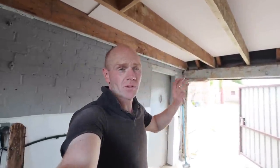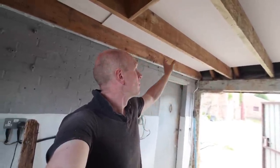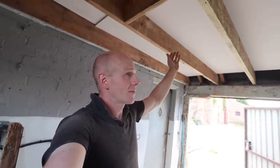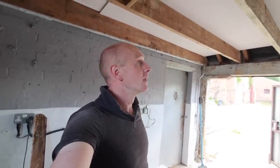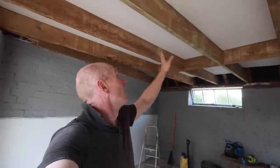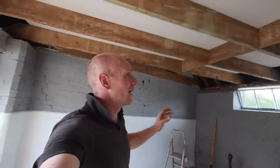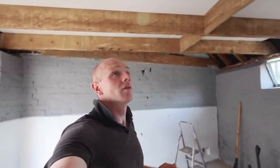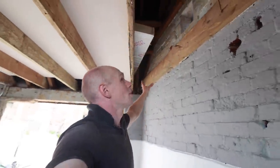I need to get up there now with some screws. I'm trying to do this in a way that I can take it all down in a couple of years' time and salvage the materials - hence why I've gone with plywood, so I can put in screws from above rather than nails, which will be easy enough to remove. Then I'll dry-lay the Kingspan sheets over the top of that. I think it's quite effective - just having that little void there is quite cool and we should be able to light it nicer and hang stuff off the beams. Now I need to cut the triangle section.